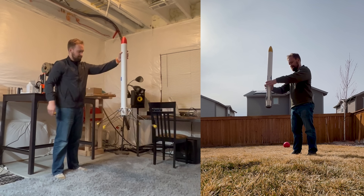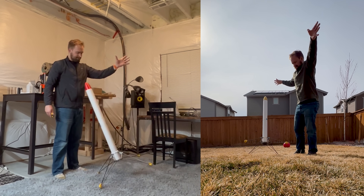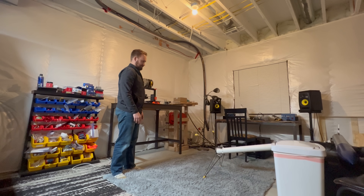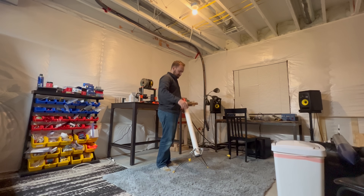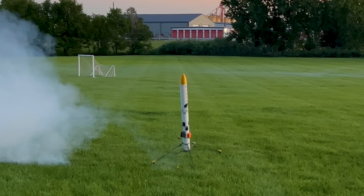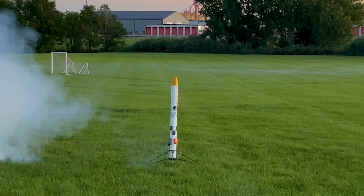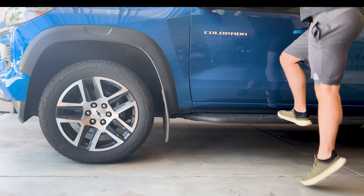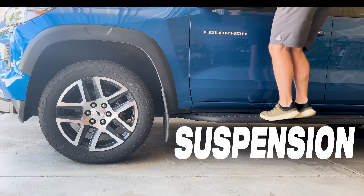When the rocket drops, it isn't able to absorb any energy, so it either tends to jump back up and fall over, or if it has any lateral movement, it tends to want to rotate and tip over. So funny enough, the reason that Eagle landed last time might have been only because the leg didn't fully lock into place, and therefore ended up damping that rotation.